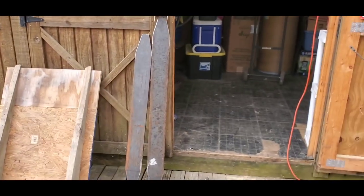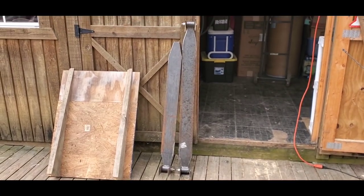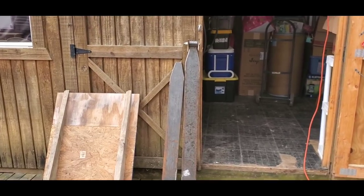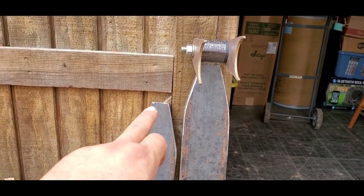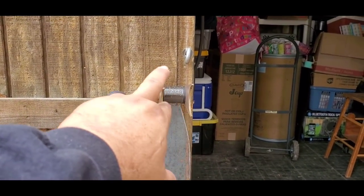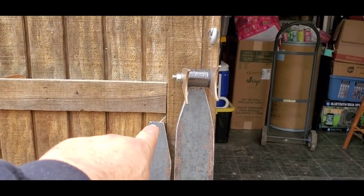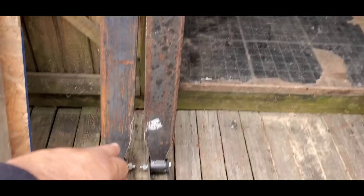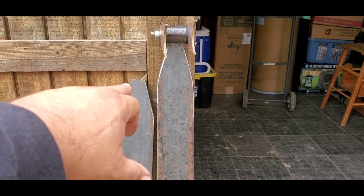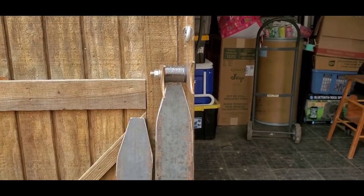All right, good morning. It is actually almost 9 or so. Recalculated and measured. I had to bring them down to 3 foot 4 inches, 3 foot 4 inches to center of the link end, which is where that's going to be. Now, remember, you have to account, this is 2 inches, so to center would be 1 inch from the outside edge. So this is actually sitting at 3 foot 3 inches from center here all the way to that edge there, because another inch would be 3 foot 4, and that would make it to center of your link end. So that's what I'm doing there.